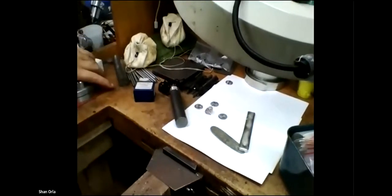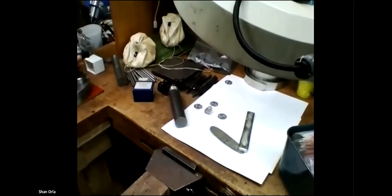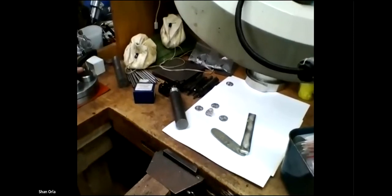Can you talk about the blanks? The answer to all of that is yes. I have bought many aluminum blanks from The Ring Lord — theringlord.com. Although they're a Canadian supplier, all their prices are in US dollars. Sometimes they have three-quarter inch brass blanks; he typically has aluminum ones, which are very cheap — somewhere around $6 per hundred. Recently I have been making my own: 97% tin and 3% silver.